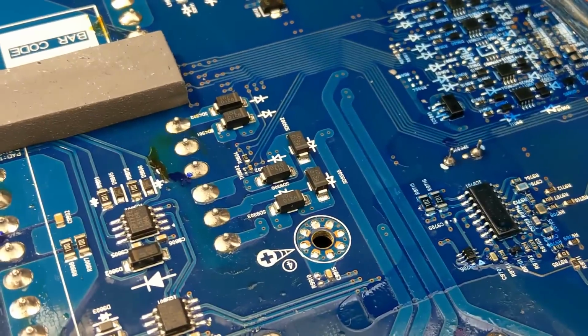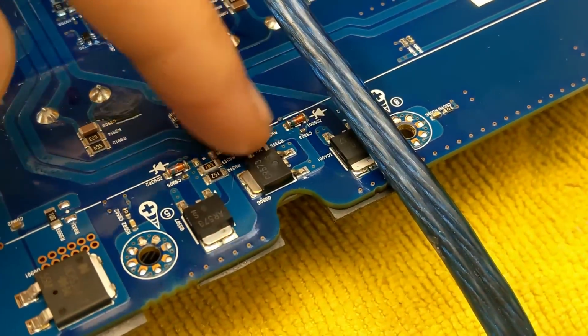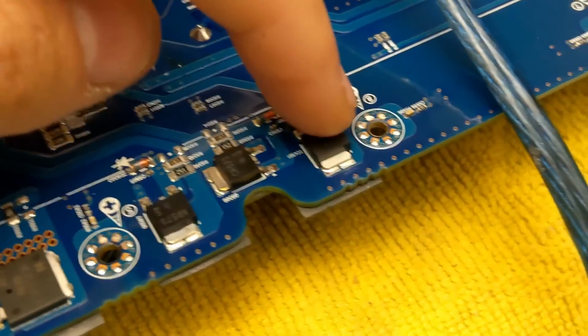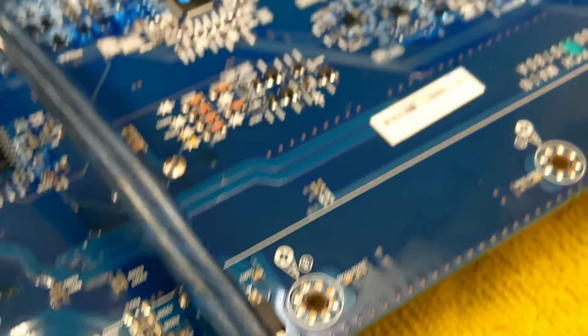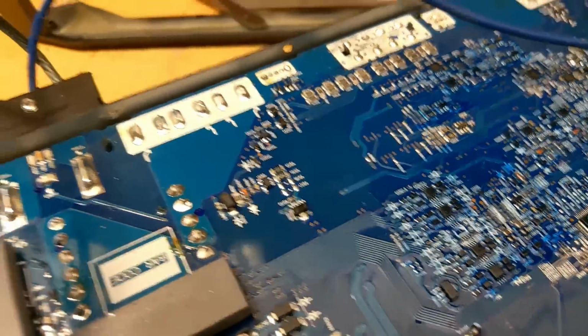And then those rectified voltages out of the secondaries get regulated by these voltage regs. We have plus minus 15 volts for the preamplifier circuit and that sort of thing. And we also have 12 volts ref negative rail for the output drive circuit, which we'll get to later. Over here is our remote turn on circuit from the remote wire.